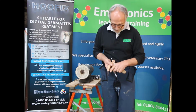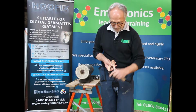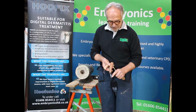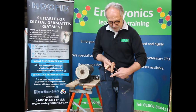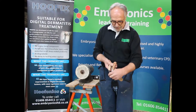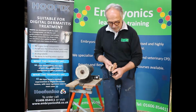actual edge on them. So the Osculate one has the shoulder of the edge starting about halfway through the thickness of the knife and sloping down to the point. Whereas the shorter blade has the shoulder right at the back of the knife, and it slopes right down to the edge. So it's the whole thickness of the knife which has the slope on it, whereas on the Osculate we've got the shoulder of the slope halfway through the blade.